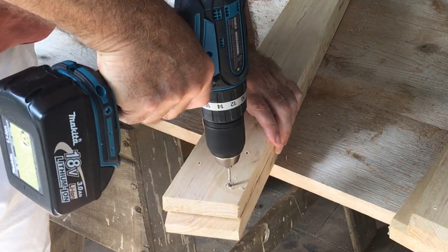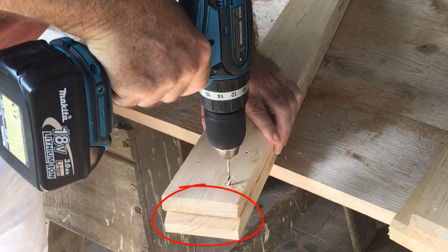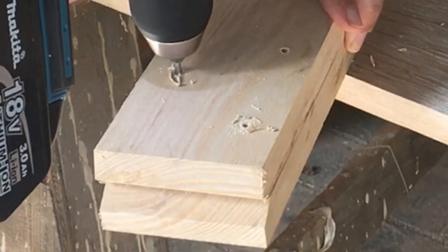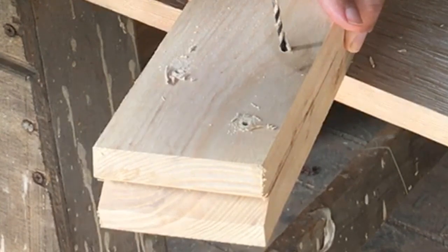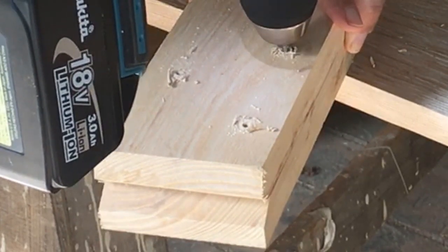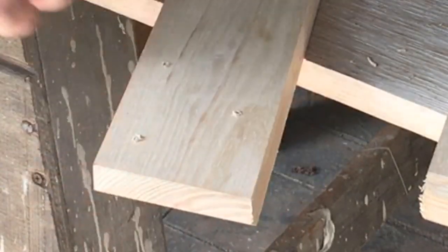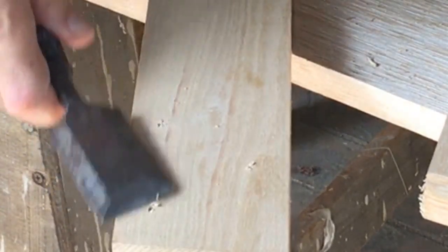Another thing I'd like you to notice is the very ends of each of the boards that I'm using for side rails. I put a small chamfer cut using the sliding compound saw in order to remove some of the bulkiness. I thought that what was visually most attractive for a rail on the side was something about 3/4 of an inch thick, but I thought that something a little bit thicker would be more stout, more steady, for me to use for railing. And so I did the chamfer in order to reduce the visual effect of it being so thick.